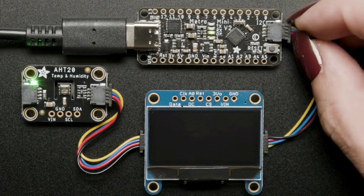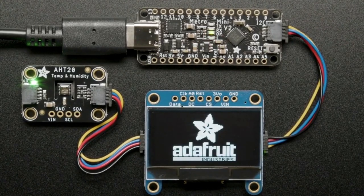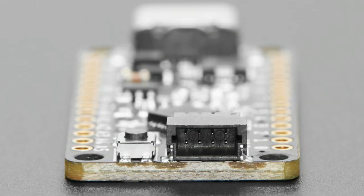And one of those things is, once you change a PCB at all, like adding anything or changing any package, you basically might as well redesign the whole thing, because you have to get a new stencil, you have to reprogram the pick and place, so you might as well make any changes. Also, things have changed. There's USB-C, there's STEMMA, there's all sorts. Once you throw out one thing from the fridge, suddenly you're cleaning out the freezer. So the whole thing got redone.